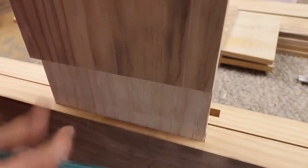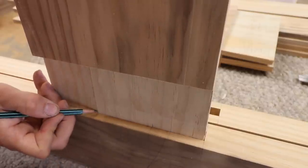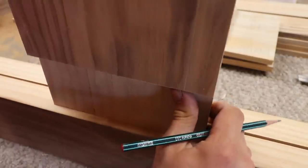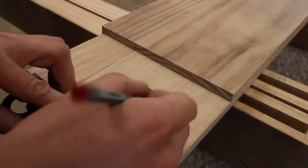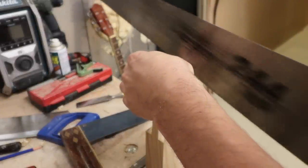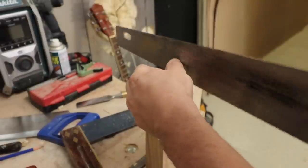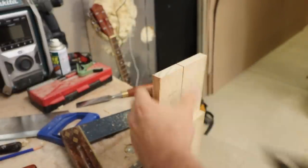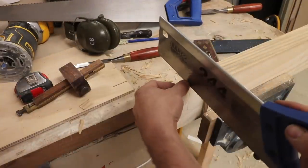So when we're setting these tenons, that's the point of reference. So we're just going to go inside of it there, in line with it there, and then this one's done. So it's just two marks on this one. It's the same principle, leaving the square set as it was. Square them lines over and mark our haunch room. That's what we're cutting out. So we're cutting haunch side of the line to leave the tenon to the thickness of the line. Turn it in the vise so we're always cutting vertically. It helps you keep everything straight. And use a tenon saw to cut the other line.